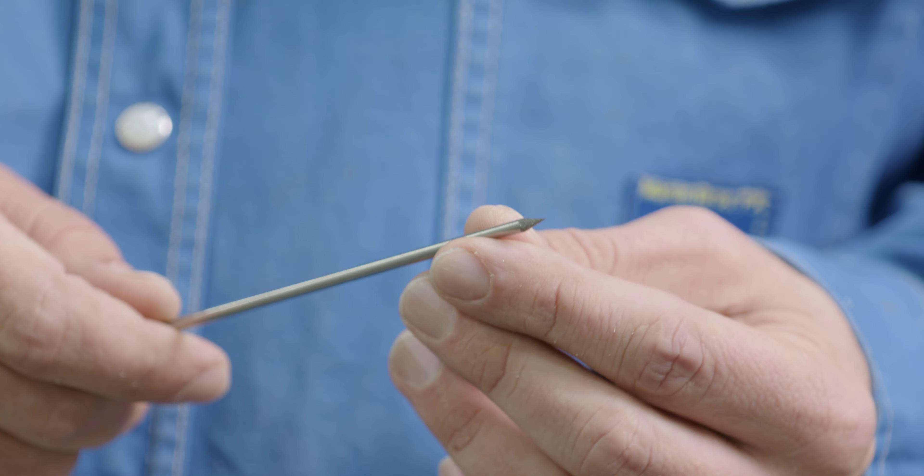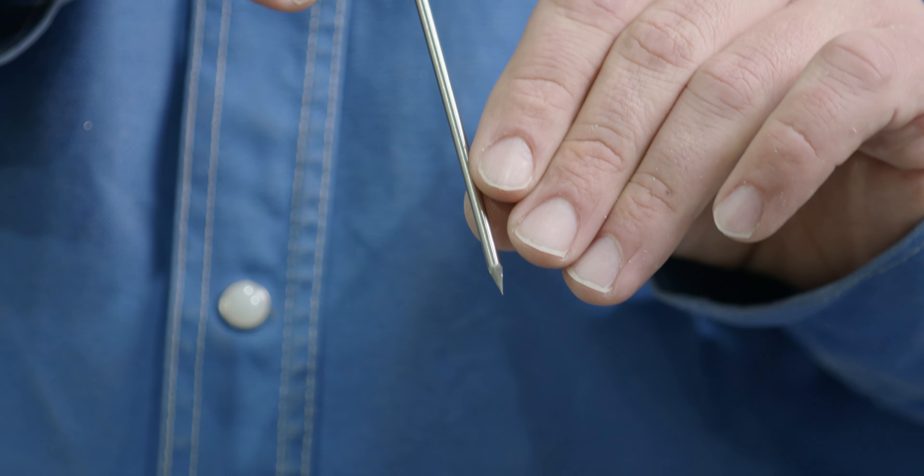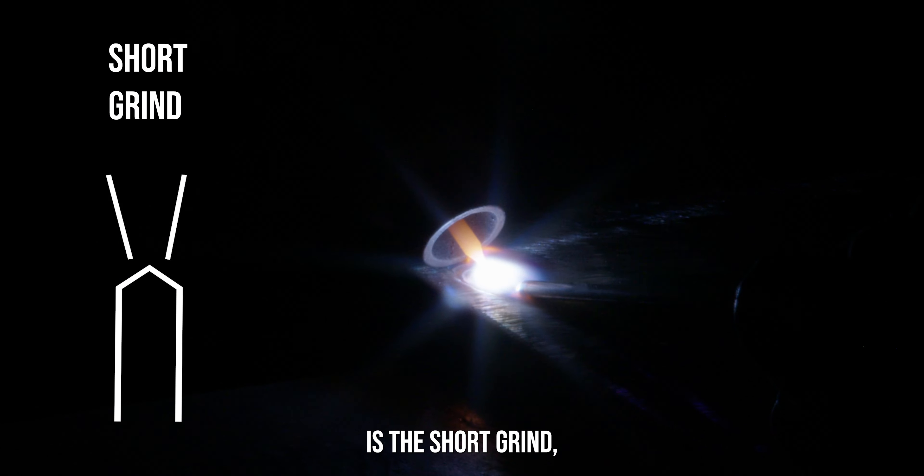The biggest thing is keeping the lines to the point. Best way to do that is with a bench grinder and a drill. The other big thing to note when sharpening with the drill: I sharpen down with the wheel rolling this way, which takes all the tungsten shavings and dumps them on the ground. A lot of people tilt up with the drill at the bottom, which pulls tungsten shavings into the chuck. When I was 12 years old learning to sharpen tungsten, I literally destroyed a nice DeWalt drill — my dad's drill — and I've never forgotten that lesson.